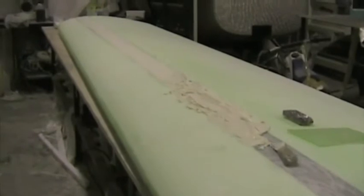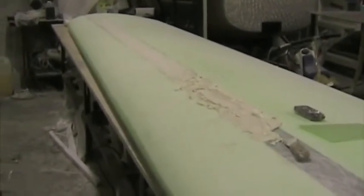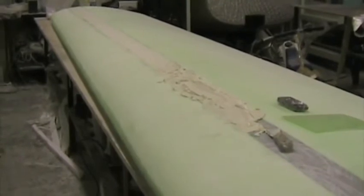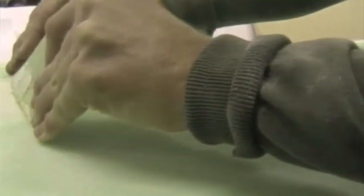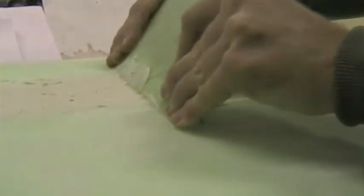The wing is now trimmed, and I'm putting micro in that slight depression on the top of the spar. I'm using fast hardener, mixing in 30% micro by mass. I've put the micro in with the putty knife, and now I'm using my straight edge, which I'm bending to suit the shape of the wing, much like we did the fuselage. And I'm slowly splining it into the groove. Best to move quite slowly so that it doesn't rip bits of the micro out.